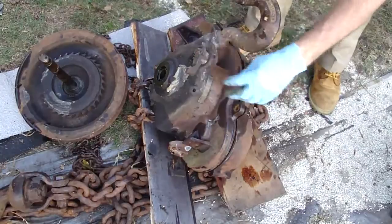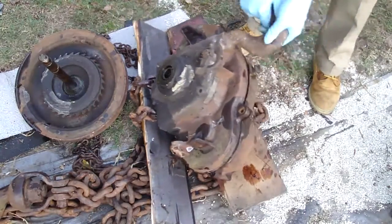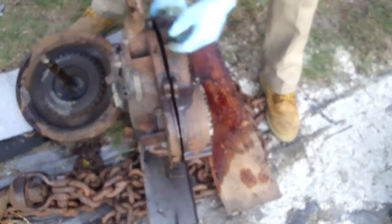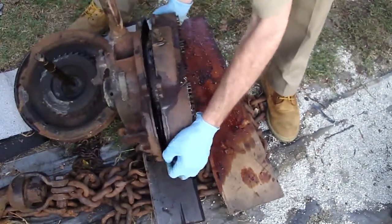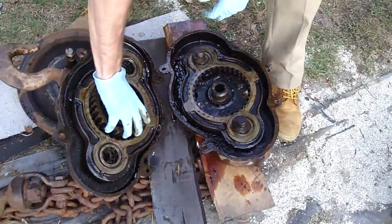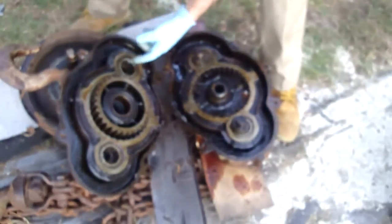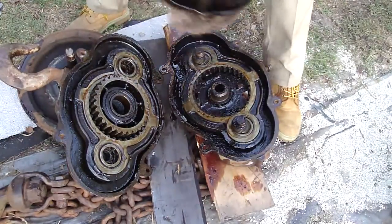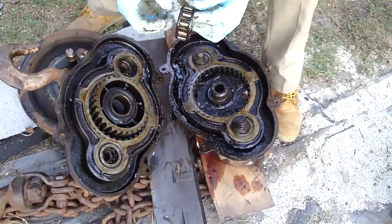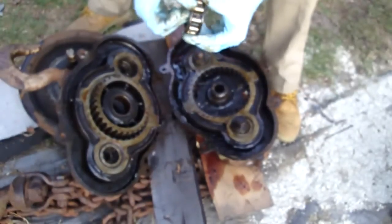If that's a brake — I don't think so. That's where the ratchet attaches. I don't see any brake assembly. It is not a planetary gear. We've got Timken bearings — some kind of Timken roller bearing here, and they're in pretty good shape. There's crud in there, but overall the rollers are in good shape, they're not scored. They just need to be soaked and cleaned. These are some kind of cam assembly — I can see how this works. It cams over and moves this one tooth at a time, kind of like how a rotary engine turns the eccentric and turns the drive shaft.